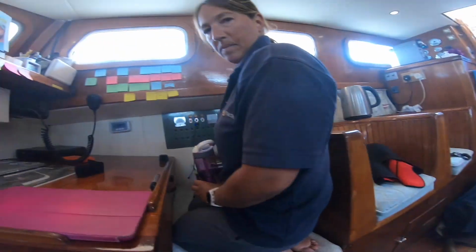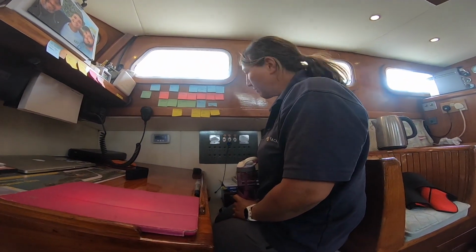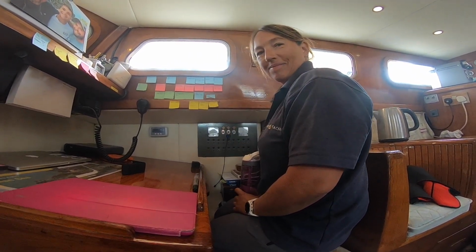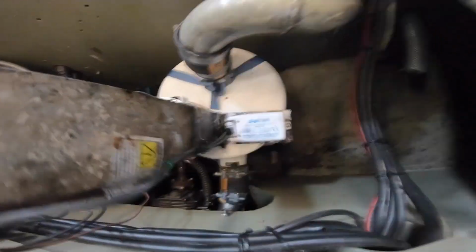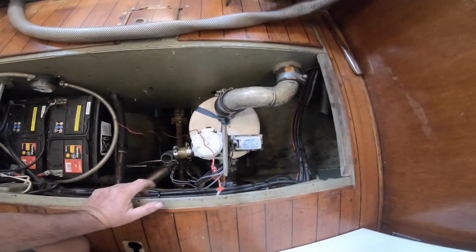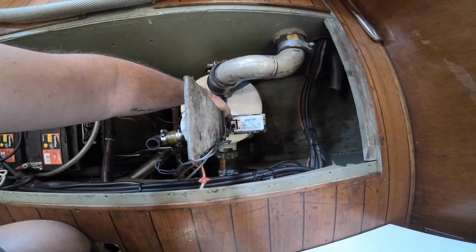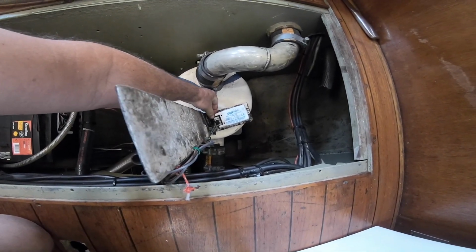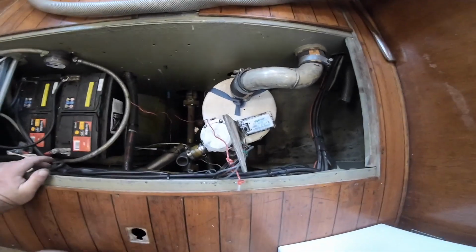Okay, so the problem was it would stay on when it was in the auto position. Can you switch it to auto for me? Oh, that's a step in the right direction. Okay, so we should now have this functional off of the float switch. So our float switch should now work. So if I do a test. Oh yeah. Yep, it's working. So we can put it back.